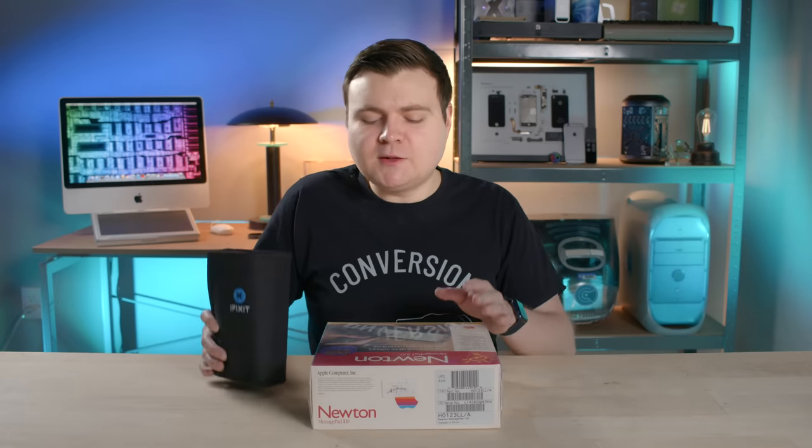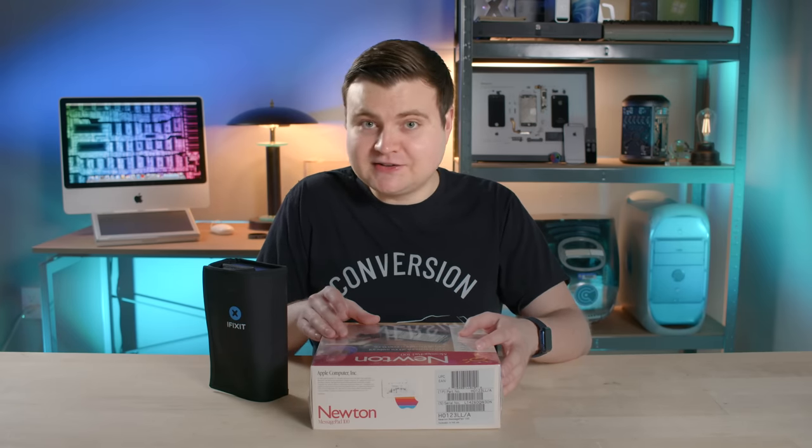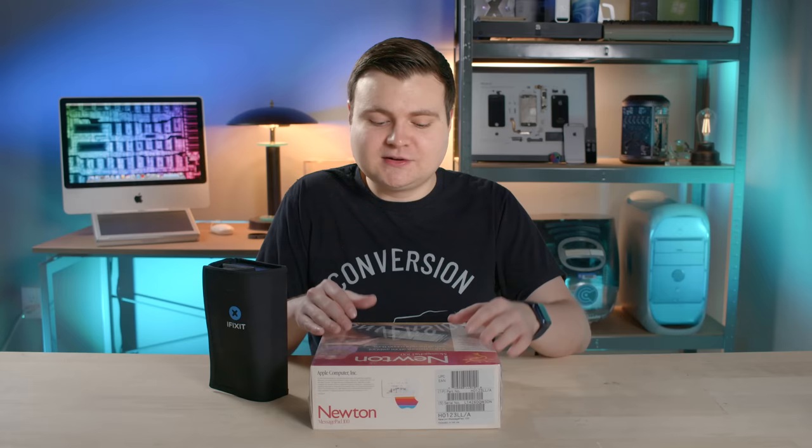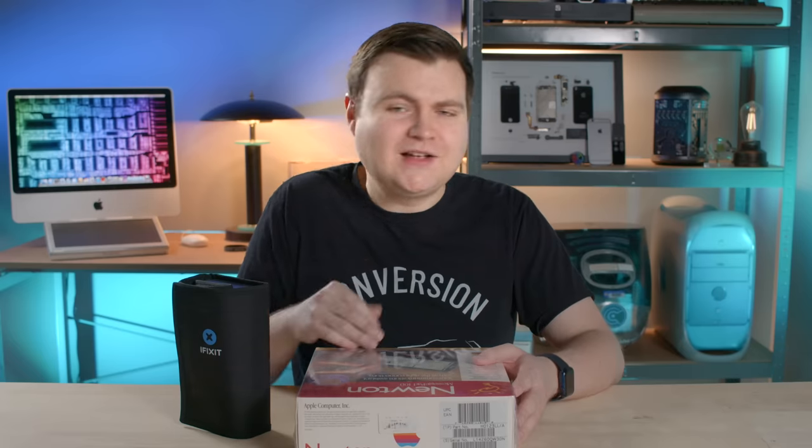So the main culprits inside this thing, just to set expectations, are the batteries and the capacitors, because depending on the types of batteries and capacitors, there's usually some sort of liquid electrolyte in there, and over time, those things can leak and cause corrosion on the board. It's only been 28 years, right?